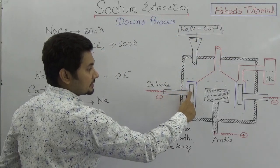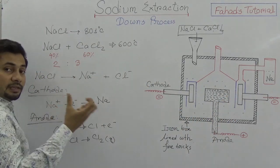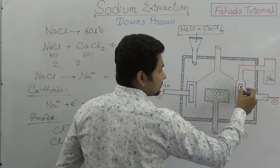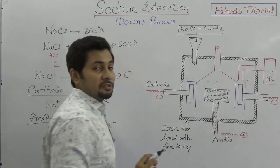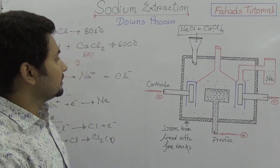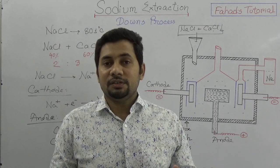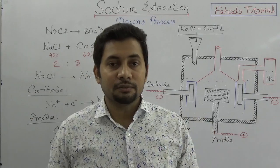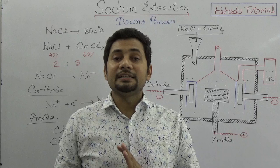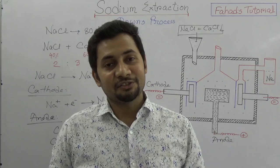The iron rod works as the cathode, which attracts the cations. The cations accept electrons to produce sodium metal. This sodium is kept under petroleum or kerosene because sodium is a highly reactive metal that can react with oxygen or air immediately. This is a very simple process for sodium extraction. In the next video, iron extraction using a blast furnace will be explained, which is very important for your exam. Students watching this video, let me know if it was beneficial or if you have any recommendations — put them in the comments section and I shall answer your questions. Take care, see you in the next video. Bye.